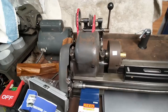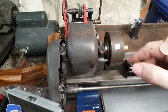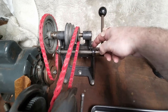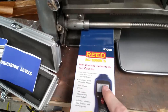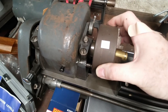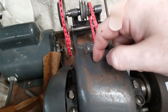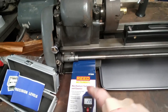I ran through all the gears — at least all the gears just with the pulleys. I didn't do any of the side gears. This is not fully engaged; you push that back and there's a little flat spot that engages with those bolts, and that does the pulley tightening. I got a Reed Instruments non-contact tachometer, put a little reflective piece on, and tested it. From the top to the first gear gives the fastest speed, and clear down to the lowest level gives about 400 something.